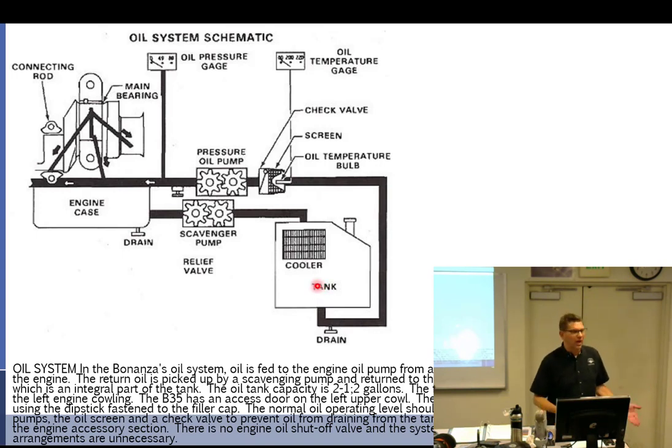The engine fills up from the tank, and so when you look at the tank, you say, wow, we are out of oil. But start it up for a second, and once the scavenge pump runs, it empties out the crankcase and fills up the oil tank. And so if you top off the oil tank and then start the Bonanza, you'll be picking up a lot of oil off the floor really quick. So anyway,